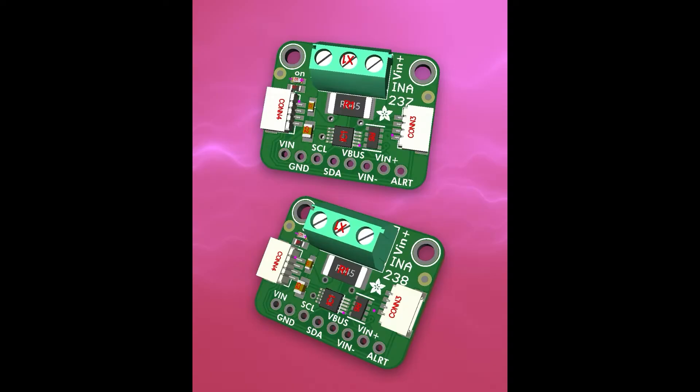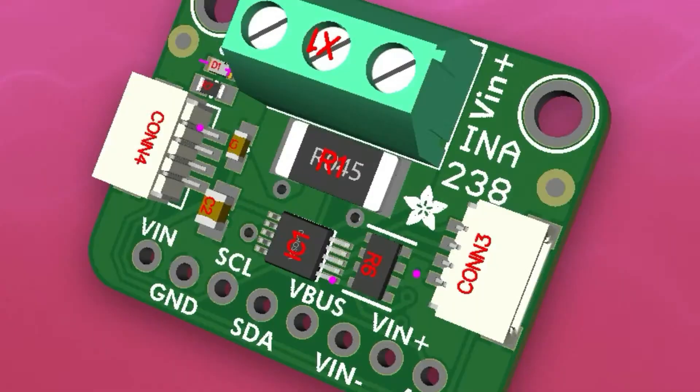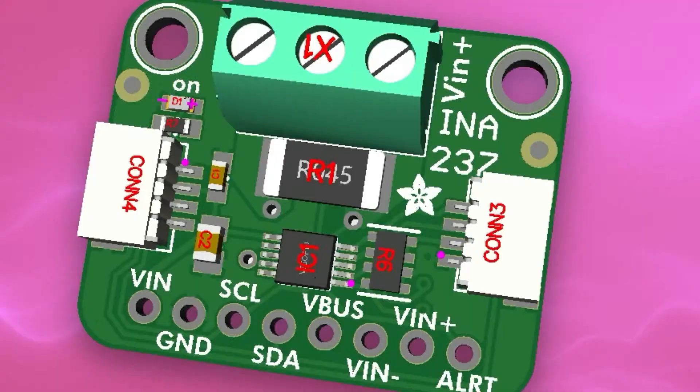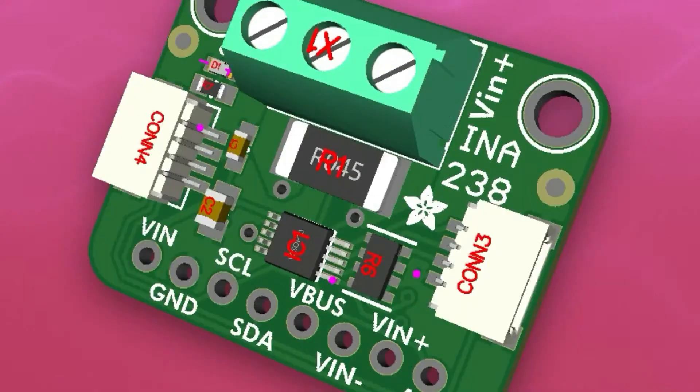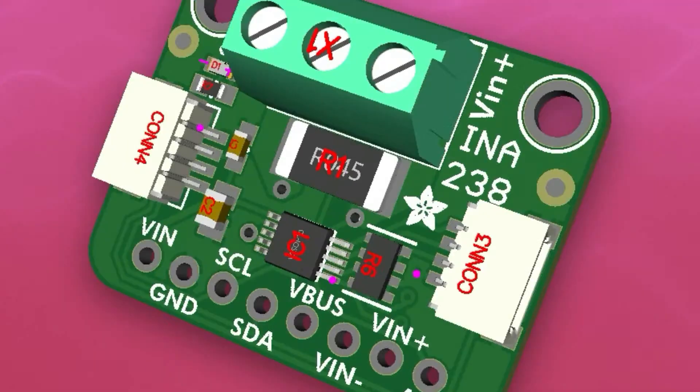I made two quick low-cost versions of the INA228, which we already carry as a 20-bit part. There's also an INA237. This has a much wider input voltage range than the INA219, and it's pin-compatible and firmware-compatible, so it's a straightforward upgrade. We'll be posting these probably starting tomorrow.